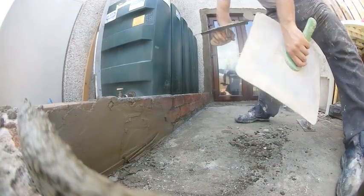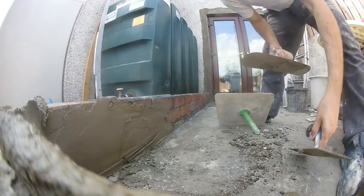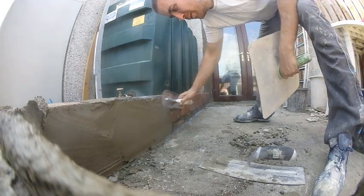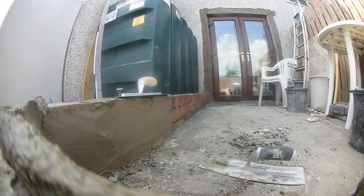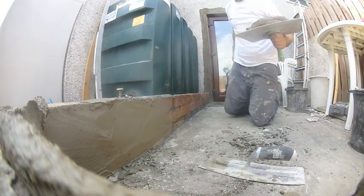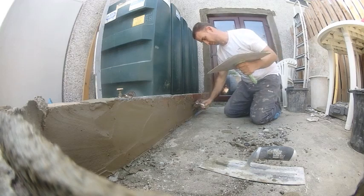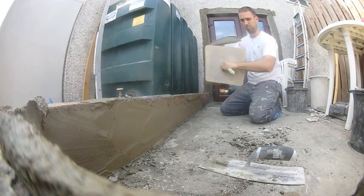Back to the SBR — I want to cover why I'm doing it this way rather than scud coating. Yes, I could have scud coated this wall; I do know how to scud coat and I know all my options. A scud coat might be slightly superior, although this method will be really strong — even the next day you'll feel the strength of this render on the brick. But if I scud coated this, I'd have to put sheets over the oil tank, over the ground, and probably board up that door to stop stuff getting onto the pebble dash.